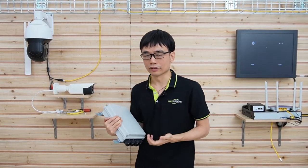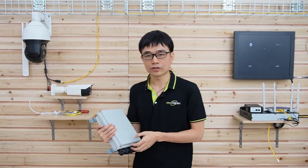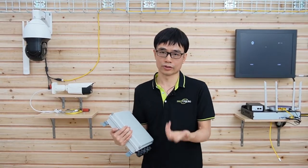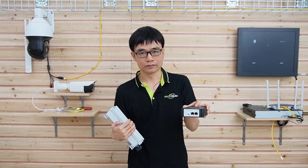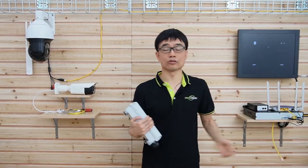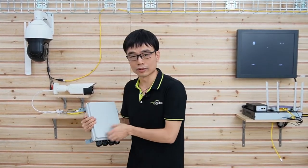You may be thinking about the power — this switch also needs power. There's one great feature for this outdoor PoE switch: it can be powered by another PoE injector or PoE switch. This 90-watt PoE injector can inject 90 watts of power through a single internet cable and send it to the outdoor PoE switch, so there's no need for a power source around the outdoor PoE switch.